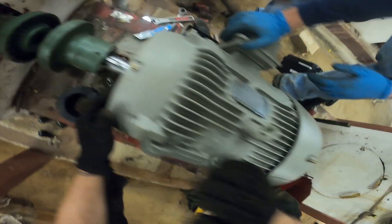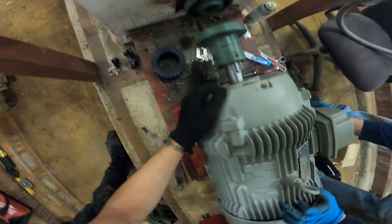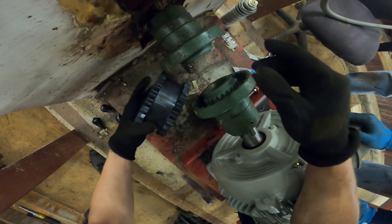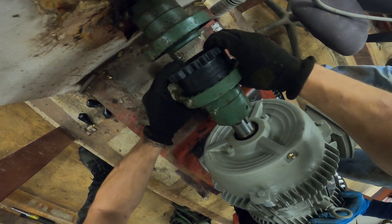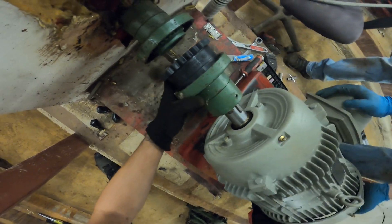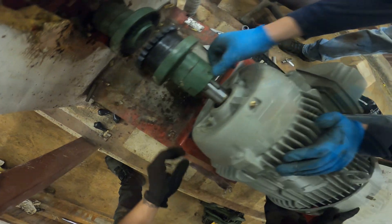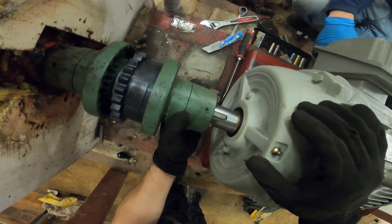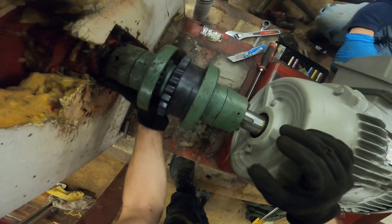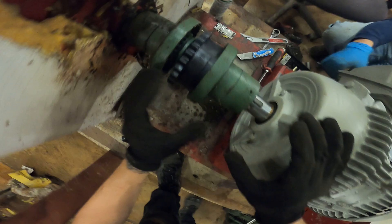Now that we have this in place, we're going to pull this motor a little bit back — not too much — just so we can fit in this coupling. This is made out of neoprene. So let's get that in place; it just fits perfectly in. And then we can move this into place as well. There's a locking nut screw here and a locking nut screw here — you want these opposite of each other. So that's going to go there, and then we slide this into place.